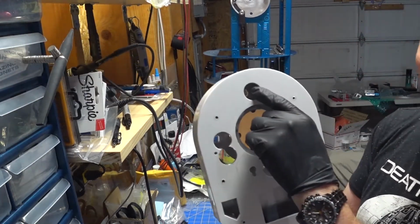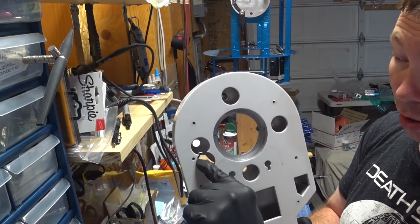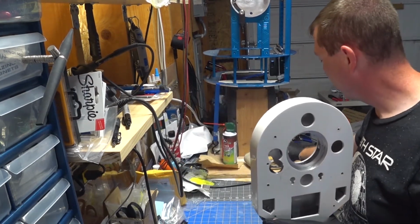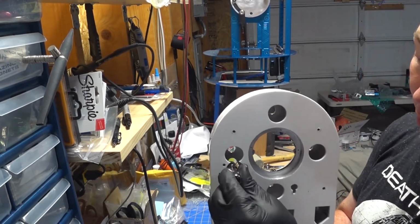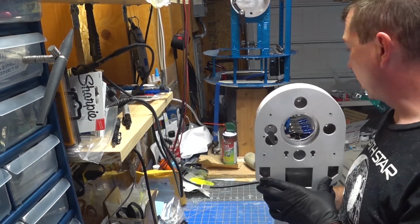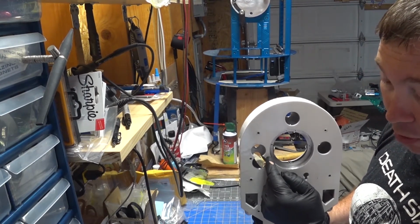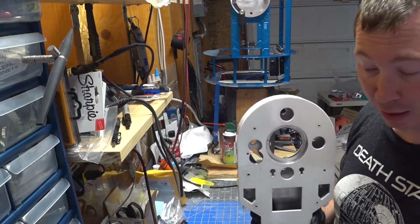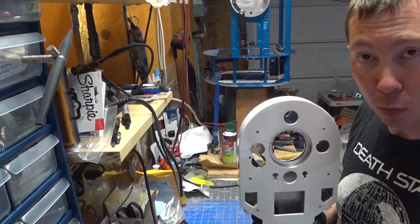So you can see here's our normal 4 leg bolt connector holes, and here's our larger hole that we added in so we could go ahead and get our 9/16 socket through cleanly with plenty of room. Gives us room to maneuver. If we had to, we could get some small pliers or a magnet in there. You know, I still haven't decided whether I'm going to square these sides off. It's not critical, but I may just do that just to make it a little easier to access, because I have a little bit more wiggle room. Not really sure yet. We'll figure that out as we get there.